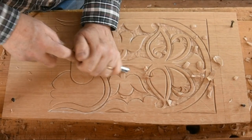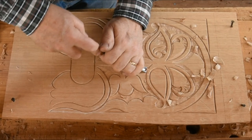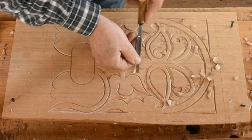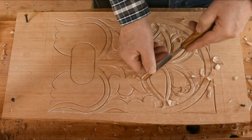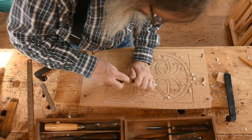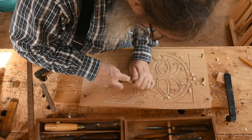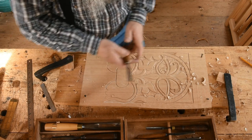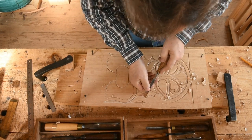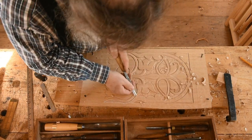There's a case where I am running along the fibers. And here I want to just slide the tool like that to follow that curve. It can come at it perpendicular to that v-tool line too. I'm probably going to use the texture punch on this background, so its condition is not really critical.